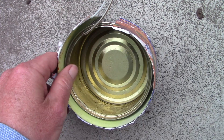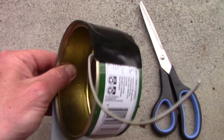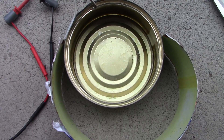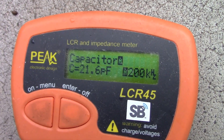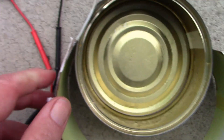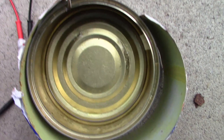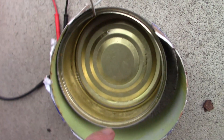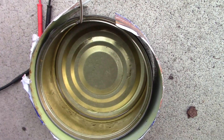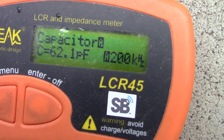Let's put it on the capacitance meter and see what sort of values we get. Here's some suitable tape. I've got it set up like this — pretty close to minimum capacitance, very little overlap between most of the metal surfaces, and it's around 22 picofarad. Just move it a little bit more, a bit closer — 40 picofarad.